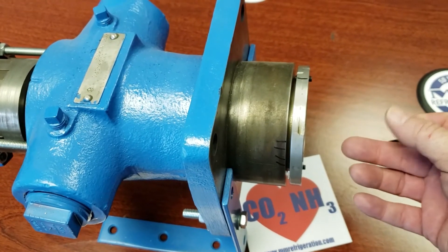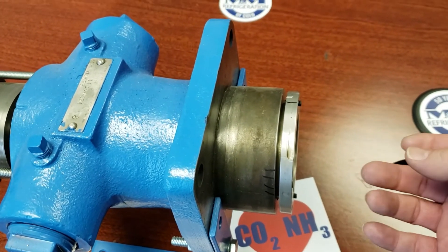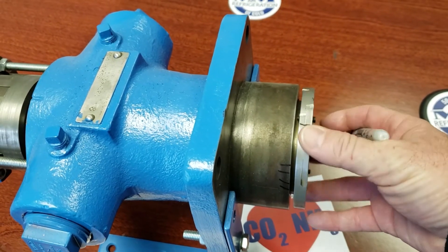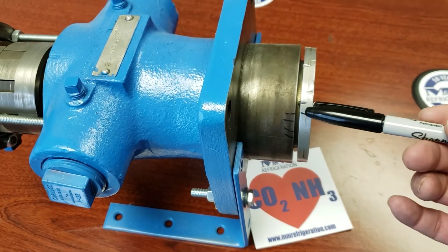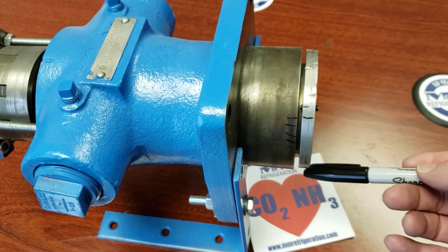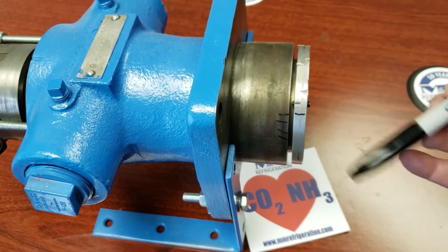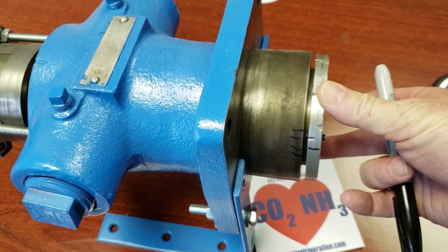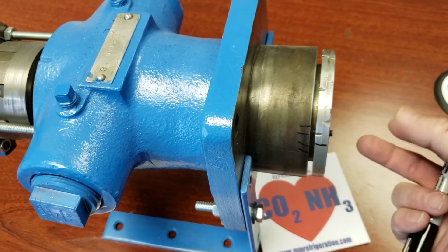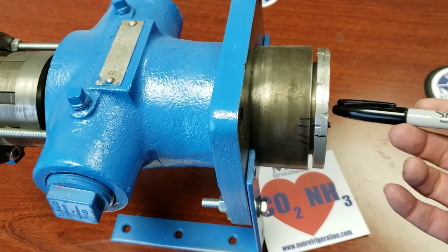Check your shaft on the motor as you go, and once that shaft seizes up and locks up, I've made some marks here on mine. A lot of these thrust bearings have notches all the way around. What you want to do is back off about three notches. At that point, the shaft should free back up, which means you've got the thrust bearing set.